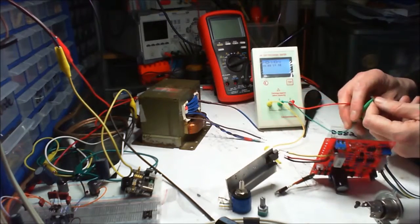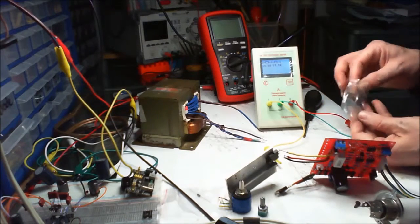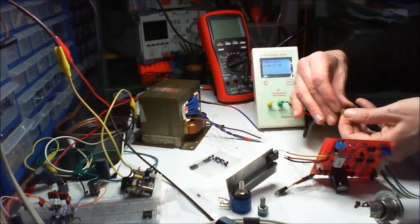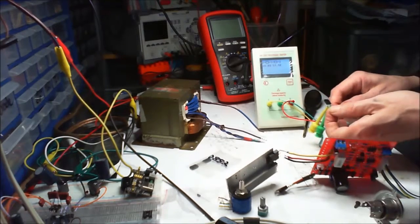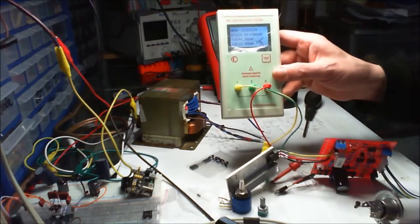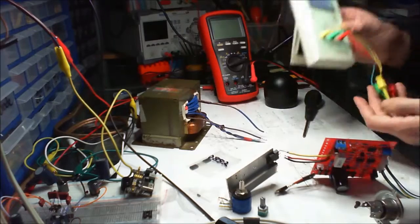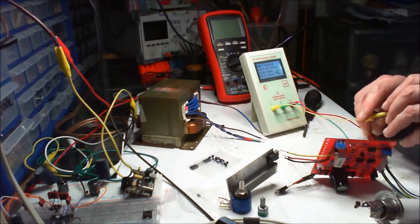No, you sort of can, but I'll just stick it up by the camera. So that's how that looks. It doesn't look very healthy. So let's take another one of these and connect it up. Don't matter which legs, does it? Let's just splay that out a little bit to make it easier for my connections. Gonna give it another retest and see how it's supposed to look. Yay, that's how it's supposed to look, like it's already transistor, NPN. So, well, I did that, blew that.